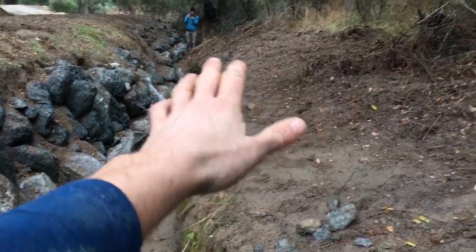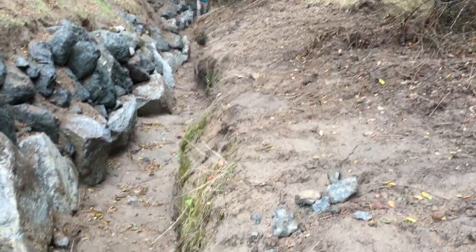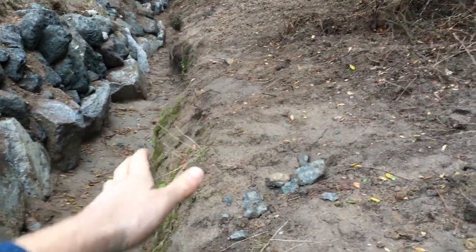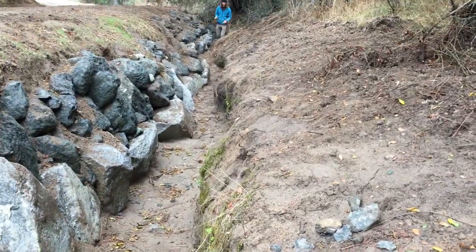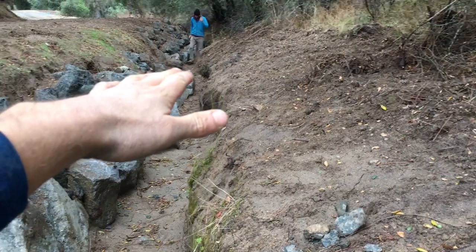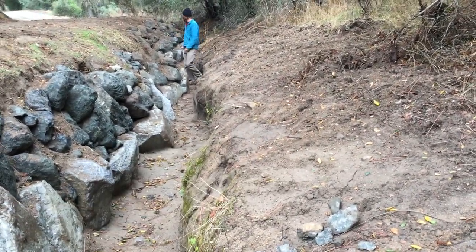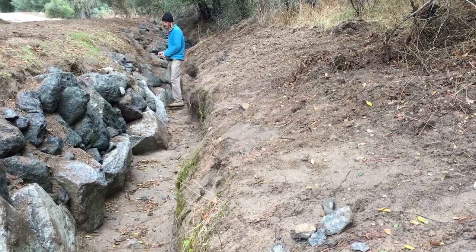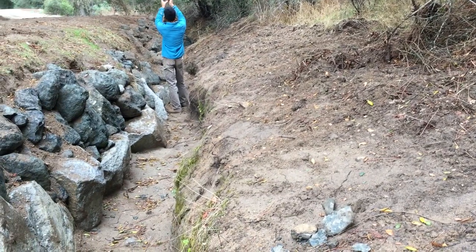The riprap will be preventing future down-cutting. Then we'll come back and seed this already fragile eroded edge with some California native grasses, maybe some coyote bush — knowing that this vertical edge is going to continue to erode and collapse, but then we'll place grade control structures throughout and actually use that material to aggrade the gully bottom. As we start to broaden the floodplain for this area, we hope to rehydrate the surrounding landscape and help moisture persist a little bit longer into the dry season.